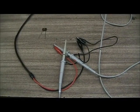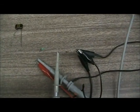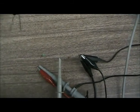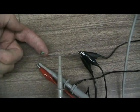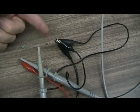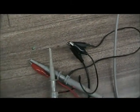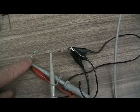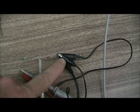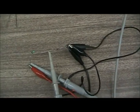Okay, here's the setup for the first laboratory. It's very straightforward. We have three components involved: a capacitor, which is used in another part of the circuit, the inductor, which looks like a resistor but it's an inductor, and then the resistor here. You can see that we're not even using a proto board in this setup. So the input source, the red wire, serves the inductor, and then that goes to the resistor to ground, all three grounds here. Now we're using scope probes because we're working at a little higher frequency.